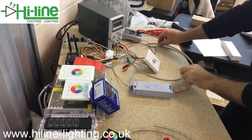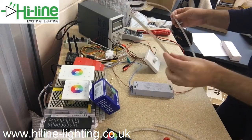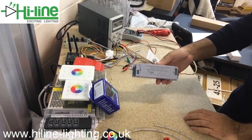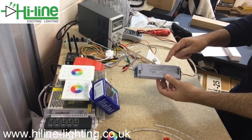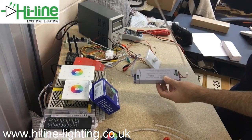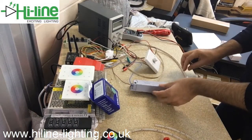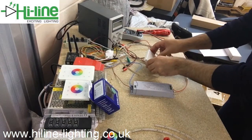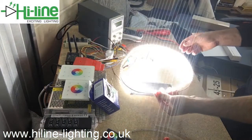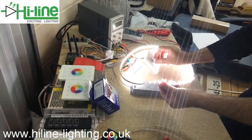I've removed half of the load, so now I have roughly 15 watts of LED strip. This mains dimmable driver is 60 watt — 30 watt load is suggested — but let's try with 15 watts, which is 14.4 watts in reality with one meter of LED strip. Full brightness definitely won't cause any trouble, and let's try to dim down the load.